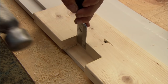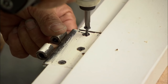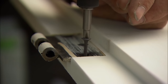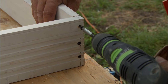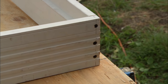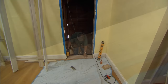Now I want to square up each corner. Now we'll move down to the second hinge. And now we screw the head jamb into the side jamb. I want to put a couple of three-quarter-inch filler strips on top of my 2x4, and then I'm going to lay my oak threshold on top of that.